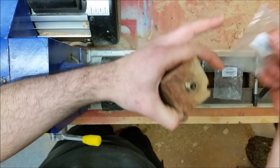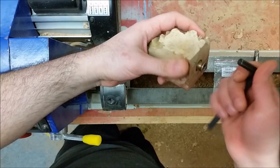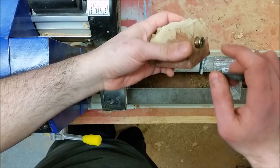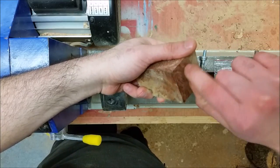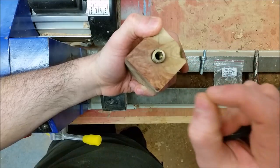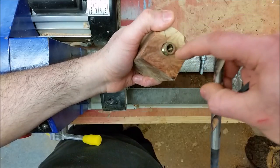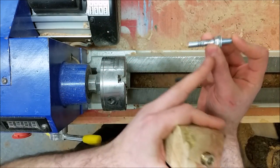I'm using a kit from Procraft — it's very easy, that's why I always use this one. You might have a different kit. I've drilled an 11 millimeter hole in the center and a 13 millimeter countersink at the top. It's best to put your countersink first and then drill the hole right in the middle, because the 13 millimeter will have the center point as a guide for the 11 millimeter hole.